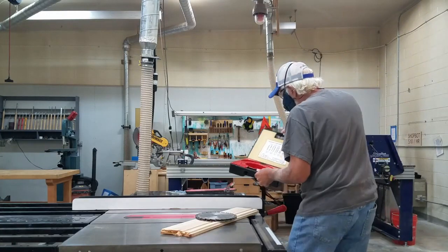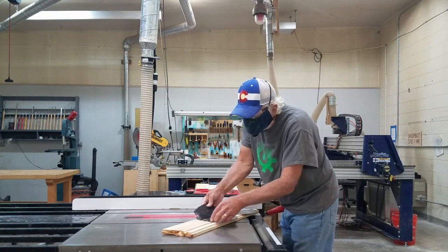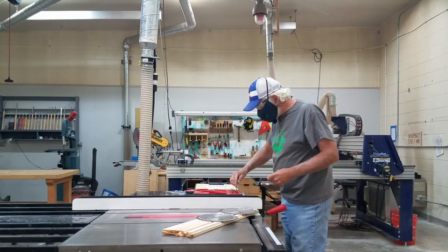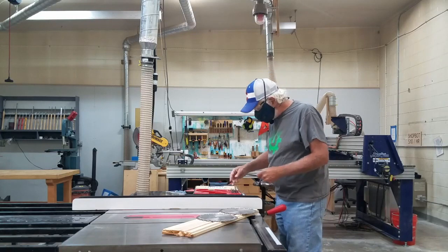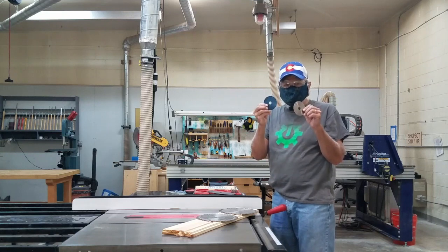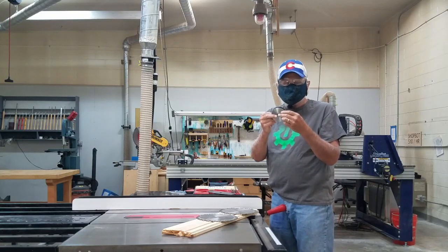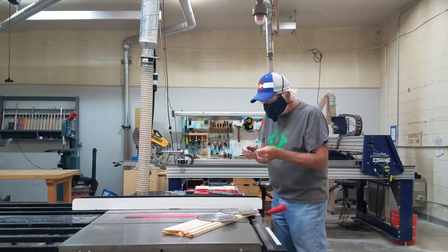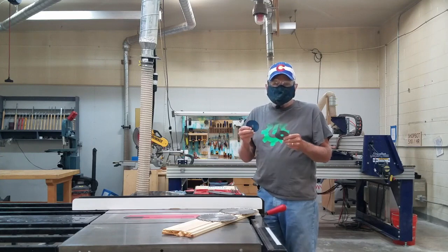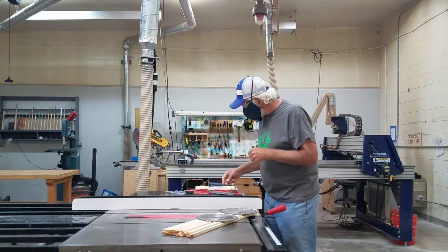There are two widths. There's one 1/16 of an inch chipper, 1/16 and 1/8. There's three of the 1/8. There's actually more in the back in the other box if you need them. Now, to fine-tune the width of your dado, you can insert a variety of shims in between the chippers. What that does is it gives you a precise width on your dado. We only have a couple washers here, but I found over the years that playing cards actually make good spacers because they're dense and they're coated with plastic and they will handle the pressure.